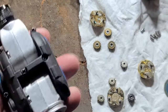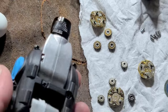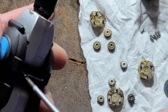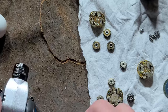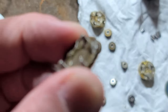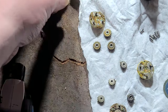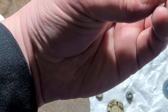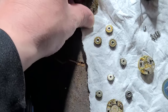That's about what it's good for really — working on computers. It's a shame that they used some terribly wrong grease — something terrible went wrong with the order on the grease and they ended up with something that I don't think is a lubricant, or they got ripped off, but it's turned into just a hundred percent plastic. It had like no oils in it. Oddly enough, you can see extra holes where this stage, in at least one design, had six gears instead of three — interesting that they could have been upgraded to six gears in the first two stages.